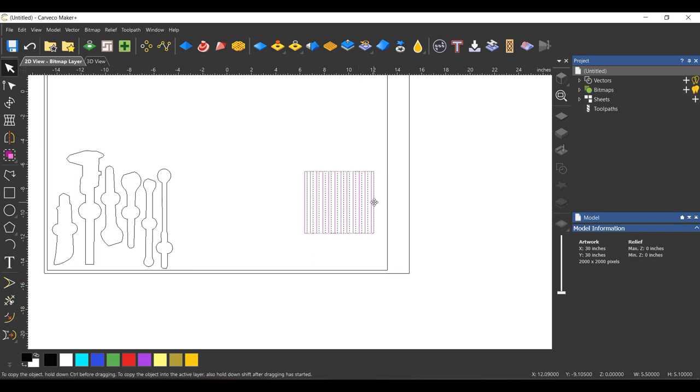And for these, I've got two different systems to hold these down on my wasteboard. I've got a T-track, and then I've got T-nuts that come up from the bottom. So I've got a regular bolt, and then I've got the T-track bolt. So rather than make a whole bunch of little holes to stand each bolt up and all that, and the washers, I'm not going to do that because I'll never put them back. So what I thought I'd do is just make a little dish right here in the bottom. That way I can have all my nuts, washers, bolts, all in this little tray, and they're easy to access.